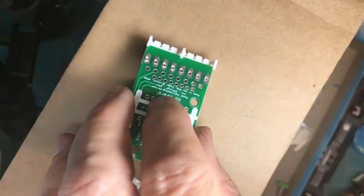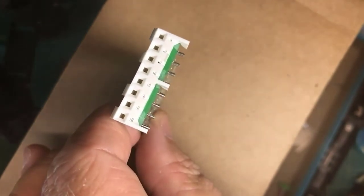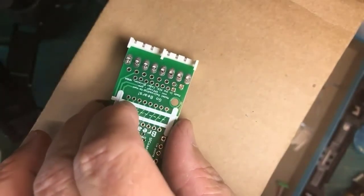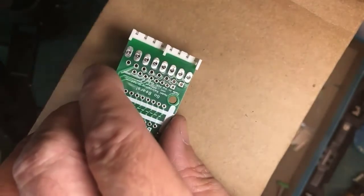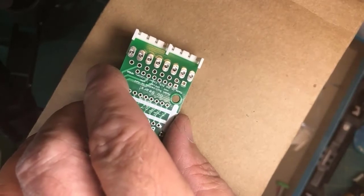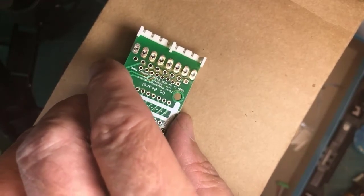Thank you. All right. Now, here you see the connector that's going to connect up to my Chubb S Mini that's going to have inputs and outputs connected through these cards. And of interest here is that you may notice that the leads are much smaller than the holes, which is an interesting challenge for soldering because it is easy to make mistakes. When the lead is a very tight fit, things work better, but this is a great way to show some of the ways things can go wrong.